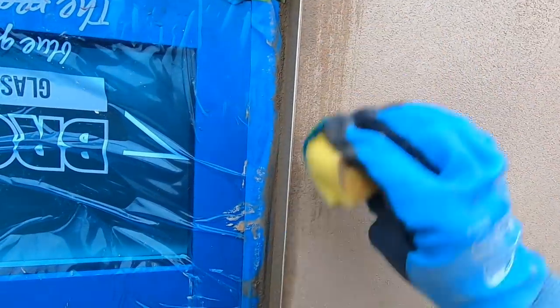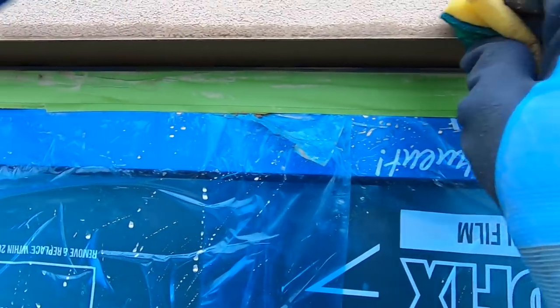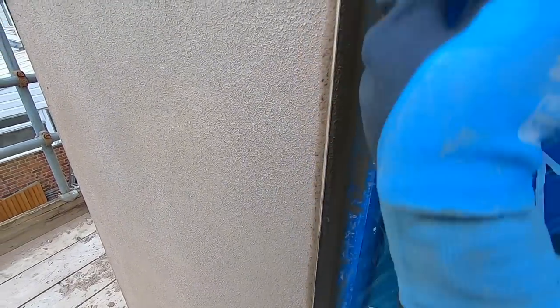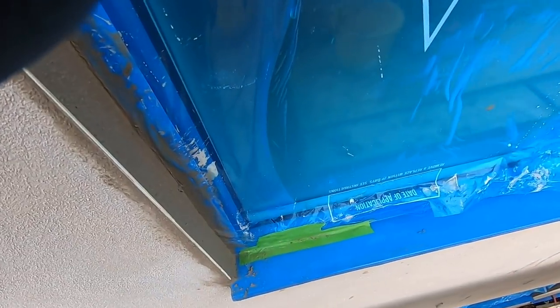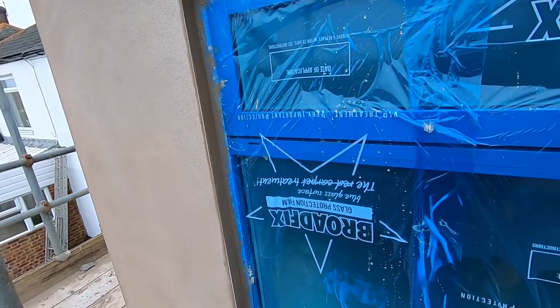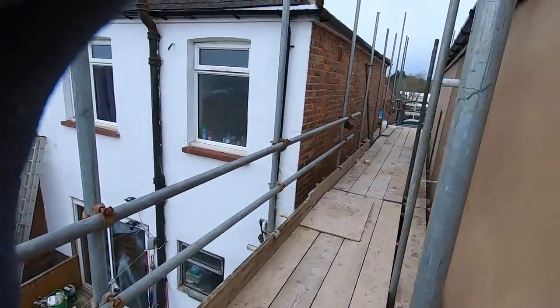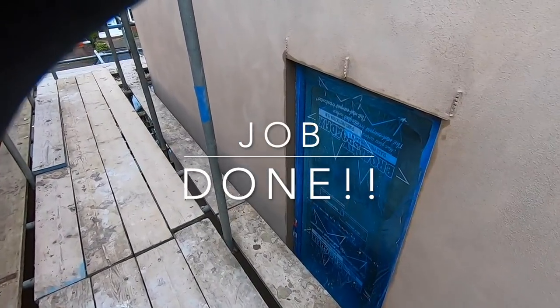Use the green-sided sponge — what I like to do is clean that bead, get it back to the white. It just really brings out that angle, gives it a sharp look, finishes it off nicely. Let's look at the render — lovely. There you go, nice reveals: took it into the window, over there, here, and then the whole side. So yeah, that's the best way to tackle window reveals — that's how you do them and get them bang on. Now I'm going to have a quick clean up, wrap this job up and I'm out of here. Happy days.